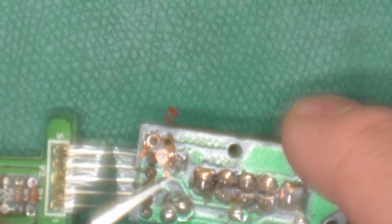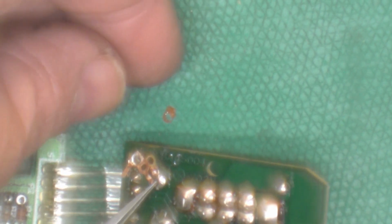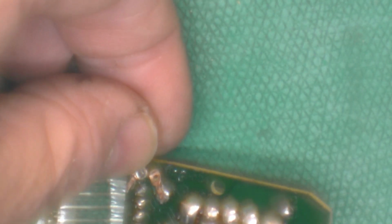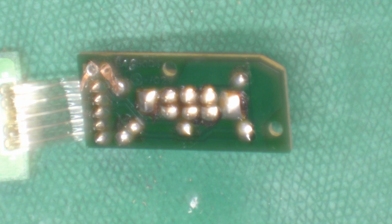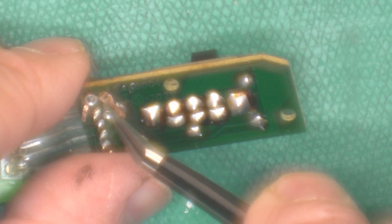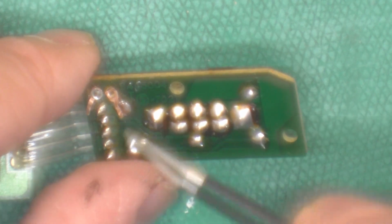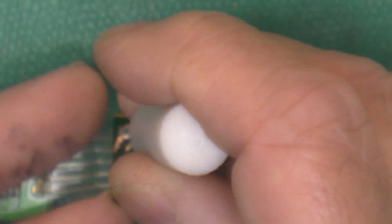I got the one done, and I'll show you what I finally wound up with. So I've got another homemade trace segment here. Could have used one out of the Pace kit as well. I'm going to try to get him roughly into place. If I had a way of holding this board a little better, that would help a lot. Then I went to using one of the Pace ferrules. These form easier. I think they are just tin coated copper, whereas the ones from AliExpress are some type of brass, which is much harder to form. Even though the listing said they were copper.